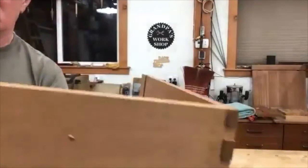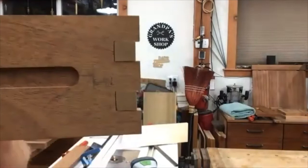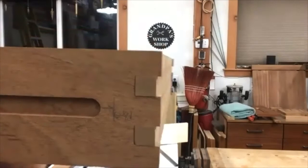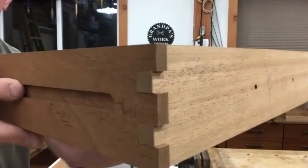And the finger joints, as in all Greene and Greene furniture, the fingers are actually proud. See how they stick out about an eighth of an inch. The side fingers extend about an eighth of an inch beyond the front of the drawer. And these are still squared off. They haven't gone through the step of pillowing them, rounding over all those edges to soften them.